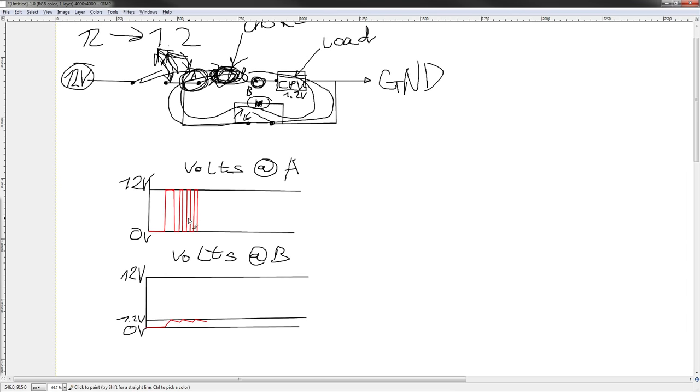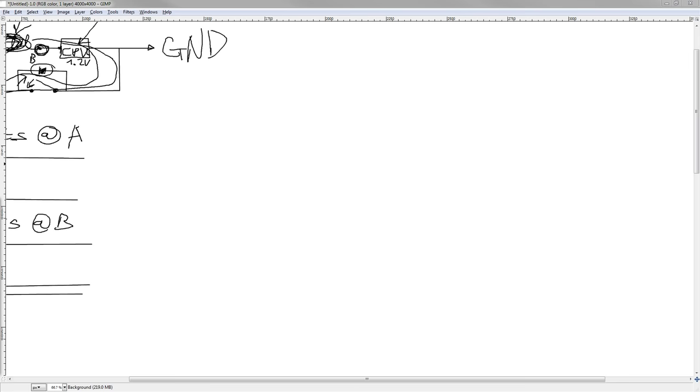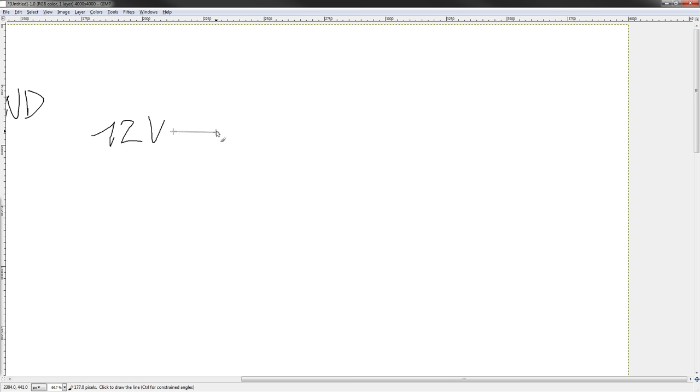If you do a multi-phase design — which thanks to my stupidly small graphs is going to be really hard to illustrate — I'm going to draw a new graph and a new circuit. This time we're going to do a two-phase VRM. From two-phase to three-phase to four-phase to eight-phase, the scaling is the same — the way they're all implemented is the same. All of the multi-phase designs work the same way. The benefits are also roughly linear: if you have two phases, they're twice as good as one phase. Three phases are 50% better than two phases. Four phases are 33% better than three phases. It basically scales right up. So I'll just explain on two phases and that'll work nicely.